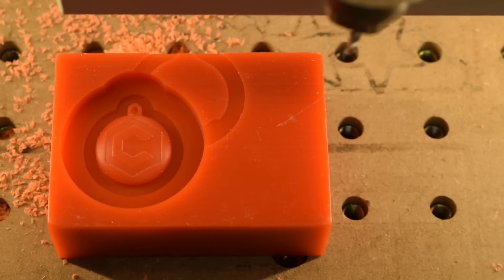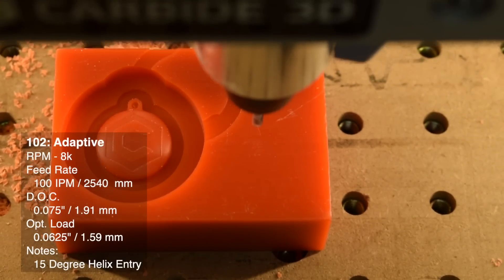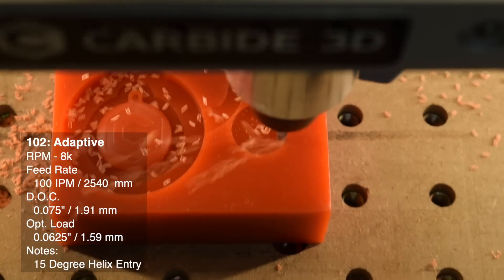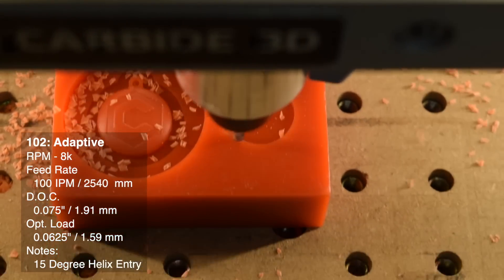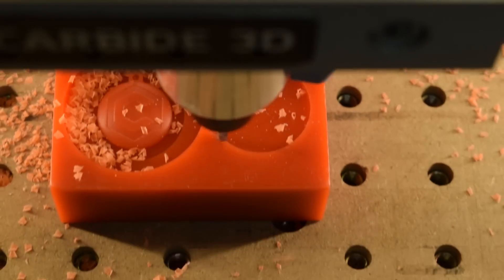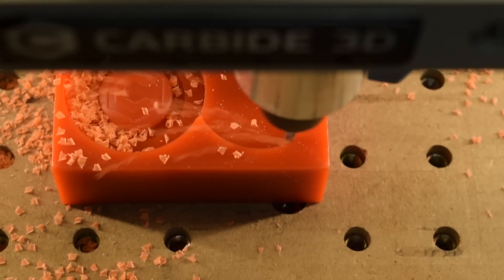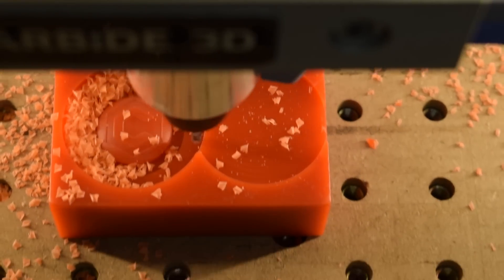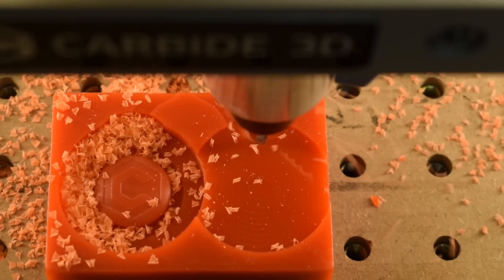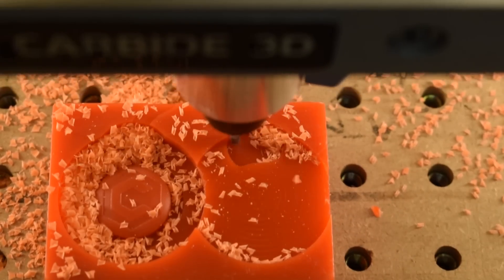For clearing large pockets, I'm a fan of adaptive toolpaths, so let's start there. I'm running the 102 1/8-inch 2-flute endmill at 8,000 RPM, 100 inches per minute, a 0.075-inch depth of cut, and an optimal load of 1/16th of an inch. The reason for the slightly slower RPM is so we can have a higher chip load despite maxing out the feed rate of the Nomad. A slower RPM means the CNC moves further between revolutions of the endmill. Chip load here is just over 6 thou per tooth, and we also keep cutter speed below 300 surface feet per minute, which helps keep heat generation low.